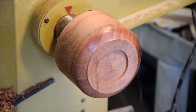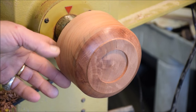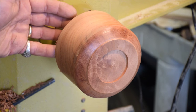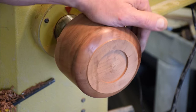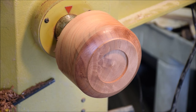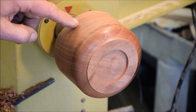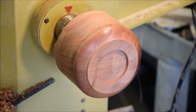So I've been getting some questions about my finishing. The main thing about finishing that most people forget about is it's just like anything else — it's all about your prep work. It doesn't matter what kind of finish you put on if you haven't done the appropriate prep work. Oftentimes I will think I've done enough prep, and I will finish something, and then once I get it in some really good sunlight I notice I should have done a little bit more step sanding or wet sanding. So it's all about the preparation process. What I like to do first — this is already very smooth, so I'm starting out here with some 180 grit sandpaper. I could probably even go to 220, but there are some pieces of end grain here that I'm going to hit first.